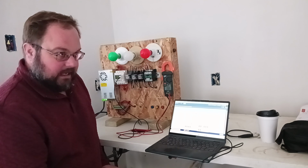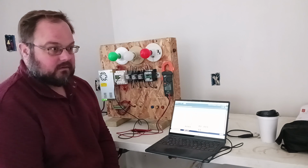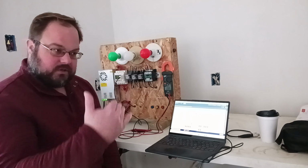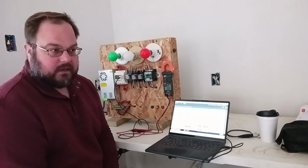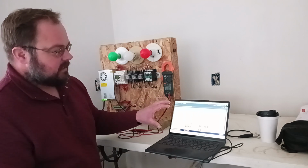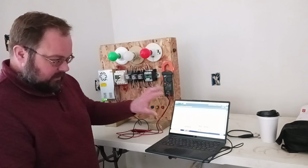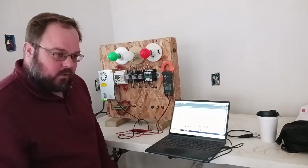There are also analog outputs, although I don't necessarily have any analog outputs on this. An example of where they would be used would be motor speed controls to a VFD. Just like the voltage changes, it'll tell the VFD what frequency to run the motor, and that will ramp the motor up or down. Also, the PLC doesn't necessarily read the analog as you think it does. The PLC actually reads the analog in bits, and there is something called scaling, where we take the number of bits that the PLC is seeing and translate it into usable information, whether that's volts or whatever.